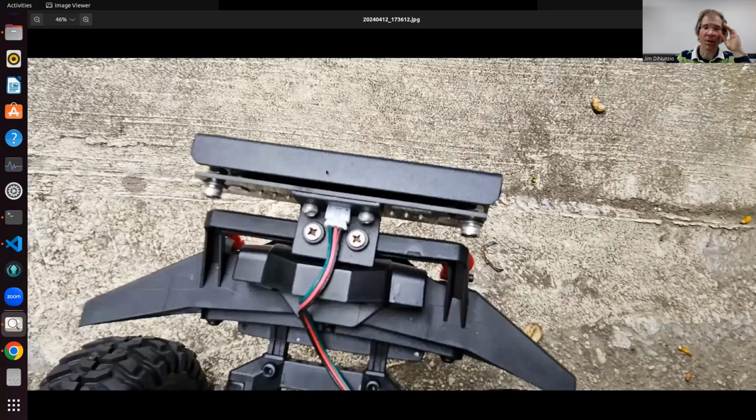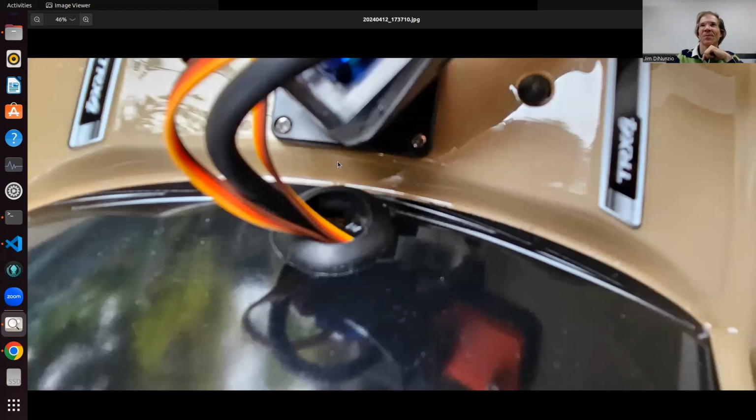And the other thing I did was install a bumper. This is a sensor that if I hit something, I'll get feedback, and that goes into the Teensy as well. This bumper I got from DFRobot. It was part of my Big Orange project, but I think DFRobot may still have those. That's just a way to know if you've hit something, and it's the last resort of obstacle avoidance. The other thing I did, going through all the mechanical stuff first, or a mix of electronics, so here's some more mechanical things.